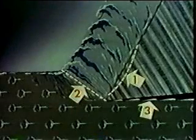When enough of these bonded contacts occur in one area, they fail to shear, and chipped material piles up on the tool face and becomes what machinists know as build-up edge. Hundreds of times each second, they pass under the tool point and remain with the workpiece. This is almost the sole cause of poor finish. So inadequate cutting fluids can be said to cause 3 problems: wear out of the tool face, low shear angle, and poor finish caused by build-up edge.